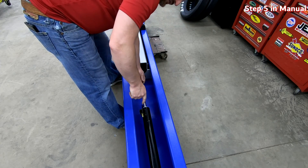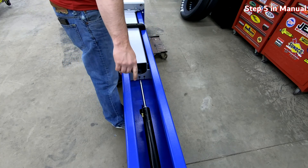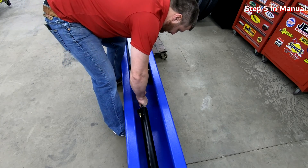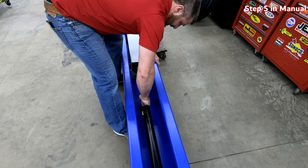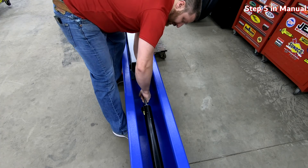Make sure you've got the cap off of each of the ports — the air port at the top of the cylinder and off the hydraulic line. That'll let air enter it, and then you can just grip the cylinder and slide it out. Take it all the way down to the base of the carriage.